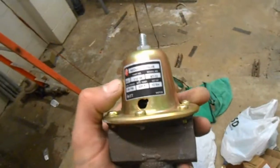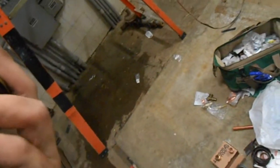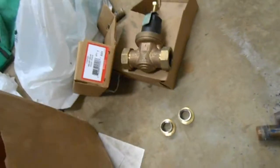We've got a proper Bell and Gossett regulator now, set at 12 psi. In the process of doing things correctly, there's always something fun. You see this one had nice little sweat adapters — it went in between fittings with a little O-ring and had a nice little union on either side, built in. This one just has three-quarter pipe threads. Ha.